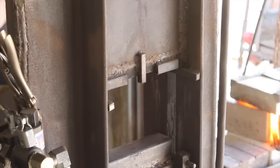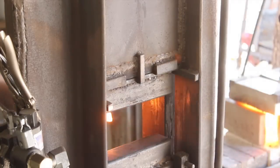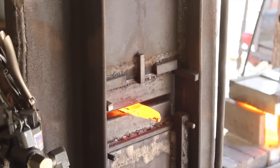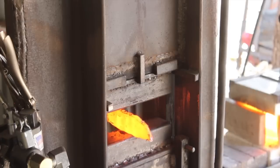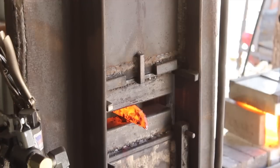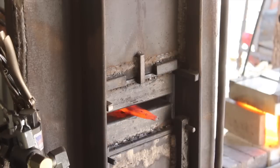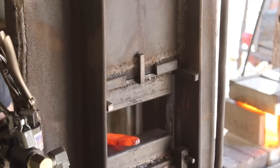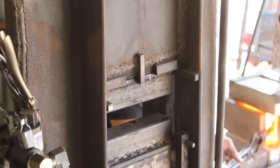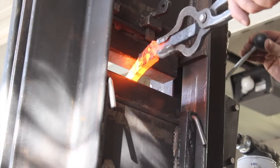Switching out the forging dies for narrower dies for better PSI and starting to squish this thing down. It's super thick right now and I'm not babying this at all — that's on purpose actually. If there's any flaw in the forge weld, this is a good opportunity with that lateral force for it to come apart. So that's my reasoning: if we're going to have a forge weld fail at all, let's do it now. Kind of aggressively forging that down.